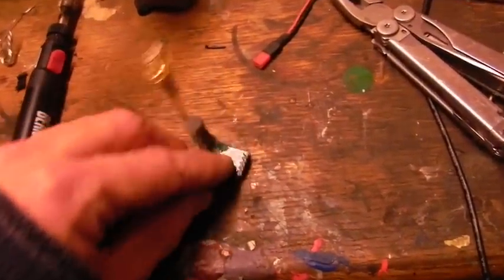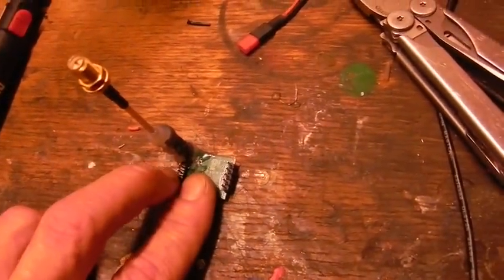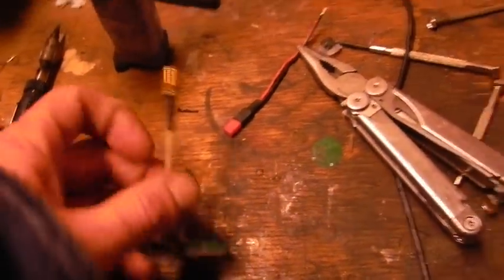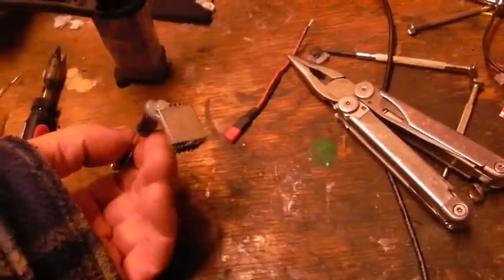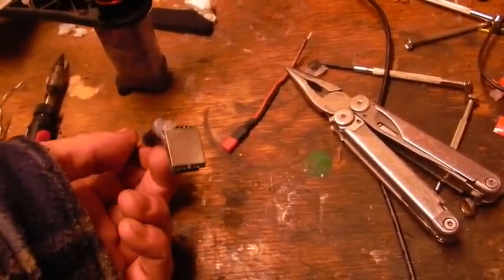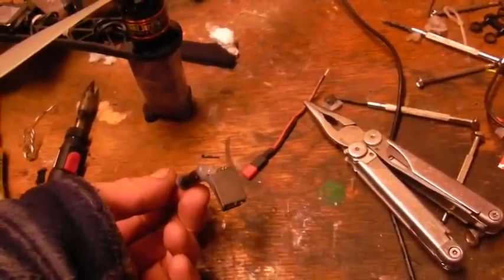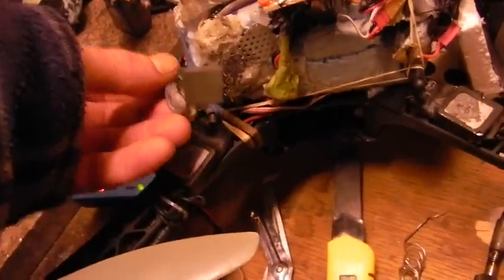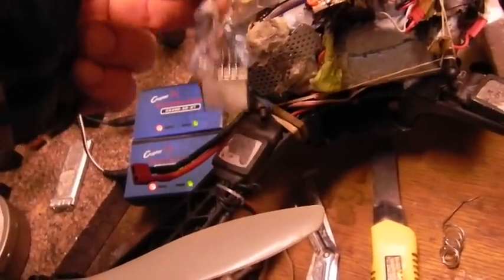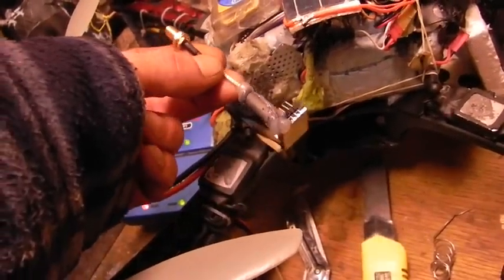Ready for power in on the first two pins, then ground, audio and video, and then channel select over here. With a light VTX like this, you could probably have two VTX units like this on your craft, and then you could switch between two receivers on different channels if you were running into trouble. So you could actually test two different channels on the quadcopter. The other one there has a longer lead, so I wanted to make this shorter to see if I got more power and whether I lost any transmitting power through having a long antenna wire on that one.